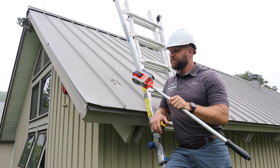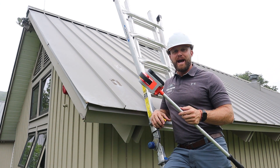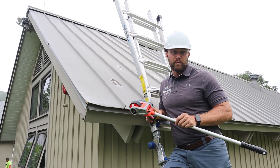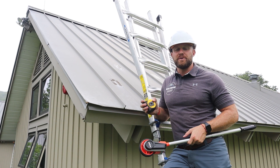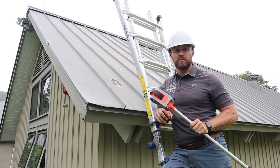I really like using a measuring wheel counter. The bigger the wheel, the more accurate these are, but even a smaller wheel like this will be accurate within 5% and typically within about 2% to 3%. It's not going to give you the most accurate measurement — your measuring tape will — but this is an easy way to get you in the ballpark. I'll show you how this works in just a moment.